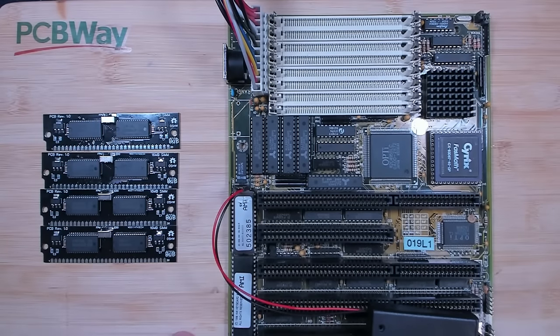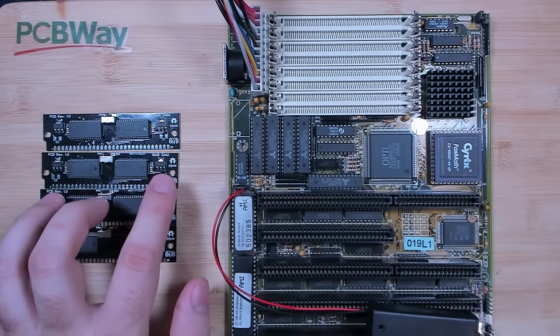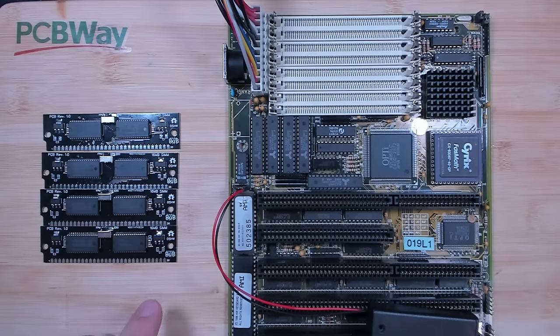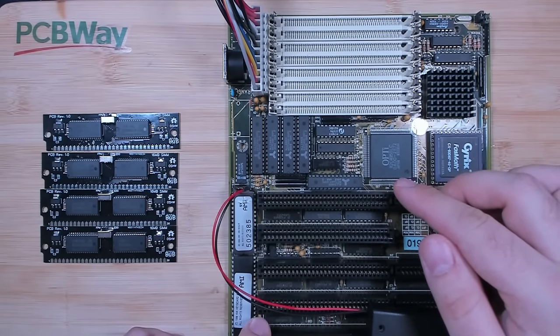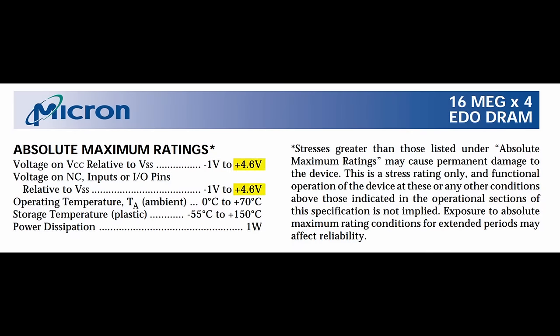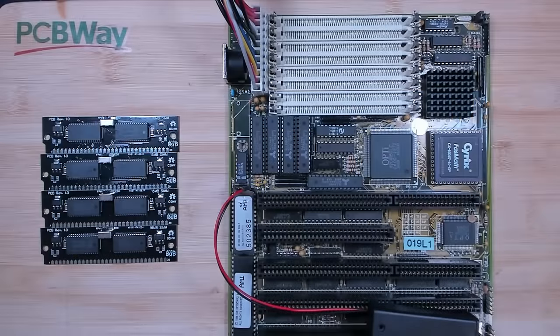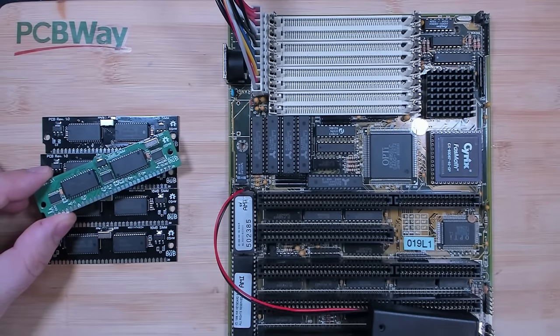But there is another problem with those memory chips, and some of you pointed this out. They are rated for 3.3 volts. We do have voltage regulators on those PCBs, but they are only regulating the power supply of those memory chips. The signal lines are directly connected to the chipset, and the chipset may communicate with 5-volt signal lines. So technically, we operate those memory chips out of spec, and this is clearly mentioned in the datasheet. I spent quite some time doing research, trying to figure out a solution, talking to experts. Today I want to share with you all the struggles I went through, and hopefully give you a small glimpse of what is to come, because I have one memory module ready that is supposed to be fully compliant with the datasheet of those memory chips.